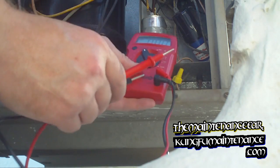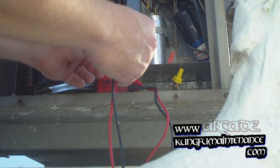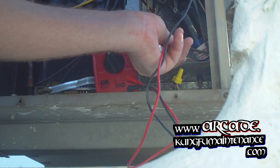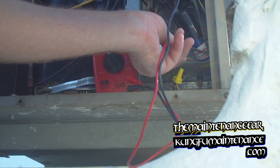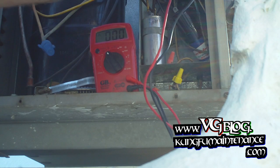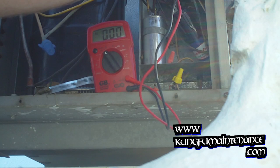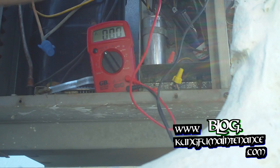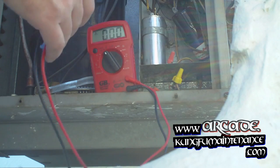I'm going to check for voltage across the contactor — this is pretty dangerous, it's got live voltage. We're going to check at the ground and then at each hot, one on each side. There's 120 on that side, 120 on that side. Now up above, across the contactor, we've got 120 and 120 going to both sides, but we do not have 220, which we should. Going to the bottom — we don't have 220 either. I think we have a bad breaker inside the unit.